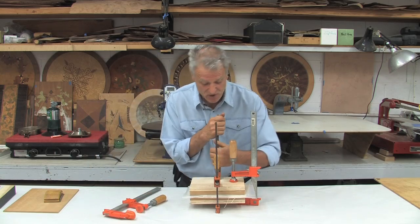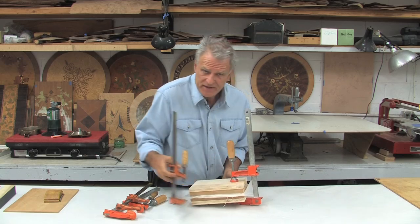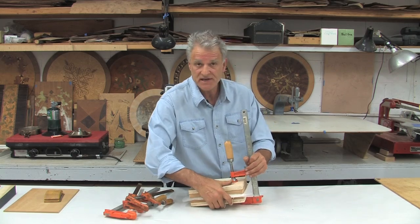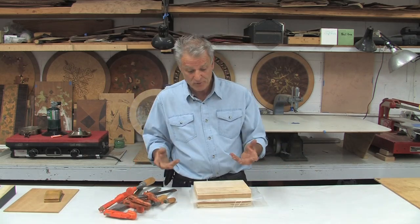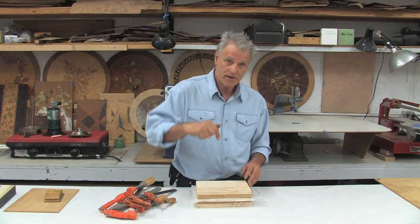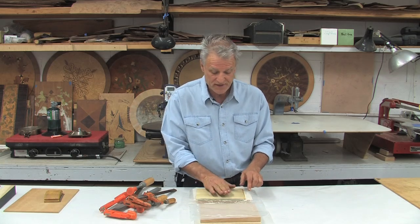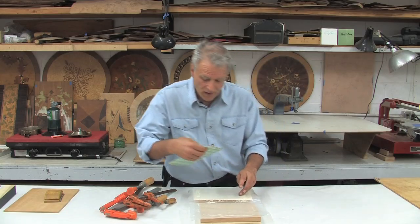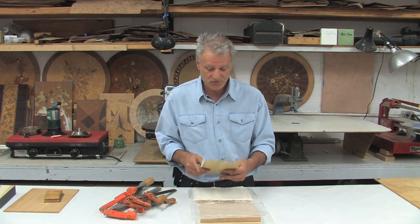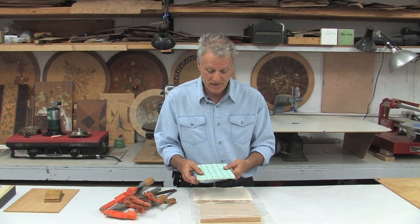This is cured for about six hours. It was nice and warm, so the glue should be pretty well cured. One thing I need to mention with using PVA — polyvinyl acetate or yellow or white glue — it comes in a sealed container and it dries by evaporation. So when I put it between Visqueen or plastic, it doesn't have a chance to cure all the way because the moisture has nowhere to go. The panel should have glued up; there should be enough air inside the veneer to have cured this glue. I do still want to leave it and let it set for probably a half an hour to an hour for the glue to completely cure before I take off my shelving paper and begin to sand.